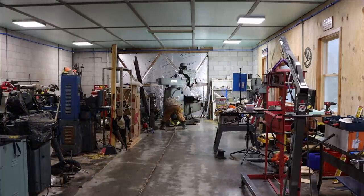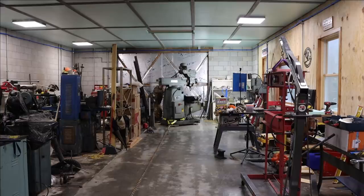So when it comes to moving equipment, I have relatively primitive tools. I have some machine rollers, I have a cable winch, I have obviously some chains and some straps and a big pry bar. And really, you can get by with that, but it's not ideal. Even turning this machine 90 degrees to get it to face the direction that you want can take 15, 20 minutes if you're lucky.